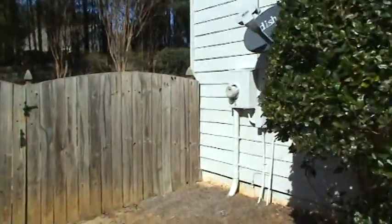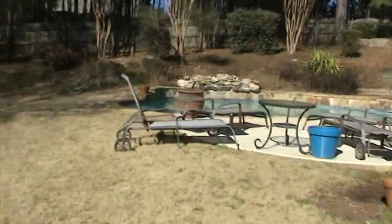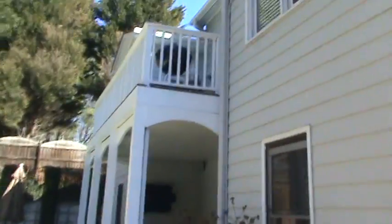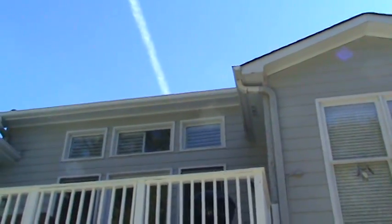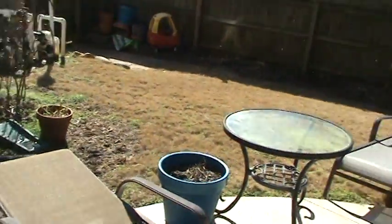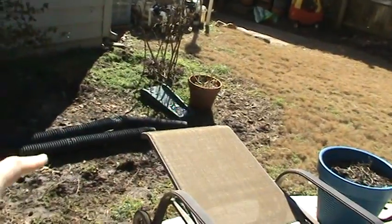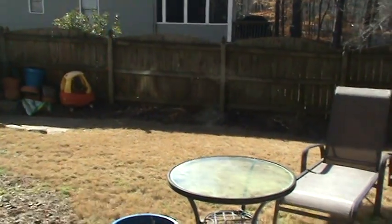We've got a little bit of a drainage issue in the back of the house — we're probably not gonna address that right now; we'll probably let that come up in an inspection. He's got some rot above the deck back here. The far right door has some rot in the left frame. We'll come back and repaint the brick mold around all these windows and doors on the back of the porch area. For the drainage, we'd trench carefully, tie all three of these gutters together, and run underground drain lines to a drain pocket in this area.